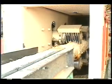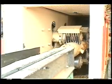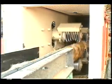When the logs are close to the same size and they are butt-to-butt, the first set of rolls will not open. Hydraulic cylinders apply force to the roll arms and clamp the log firmly. We utilize an accumulator to allow the rolls to glide over the irregularities in the log.